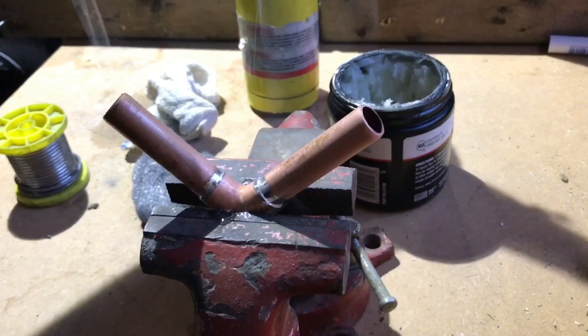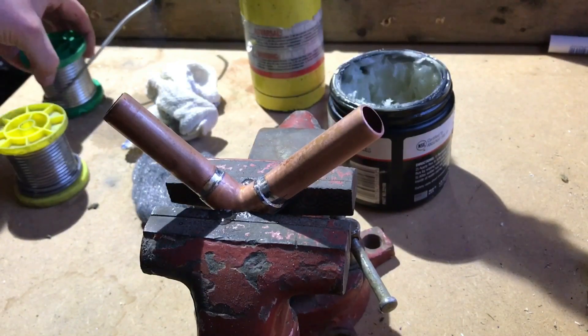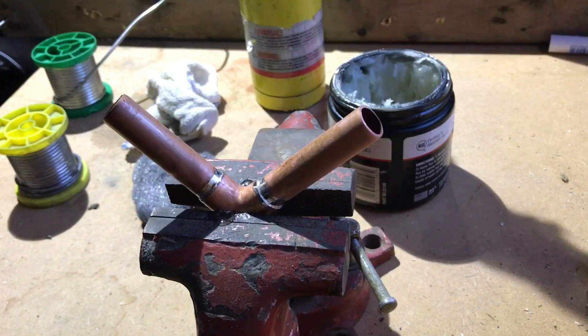So now we leave that. Some people spray it with water and wipe it with a rag straight away — that's wrong, it's too quickly and it can crack the solder and cause leaks. What we need to do is leave it to let it cool naturally, come back and do something else, and then wipe it down and polish it with wire wool.